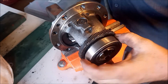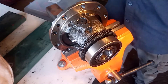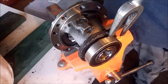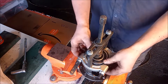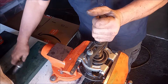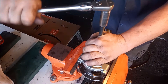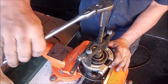It created quite a bit of clearance here, and it may be enough so that we can put a bearing puller. We pounded enough that we can get this puller set up, and we just set it in the vise for stability, and we use the normal pulling technique.